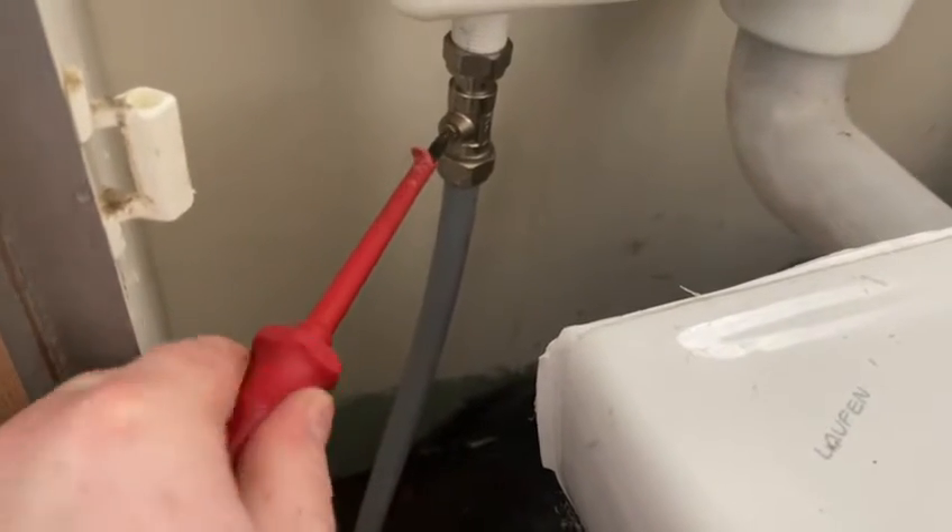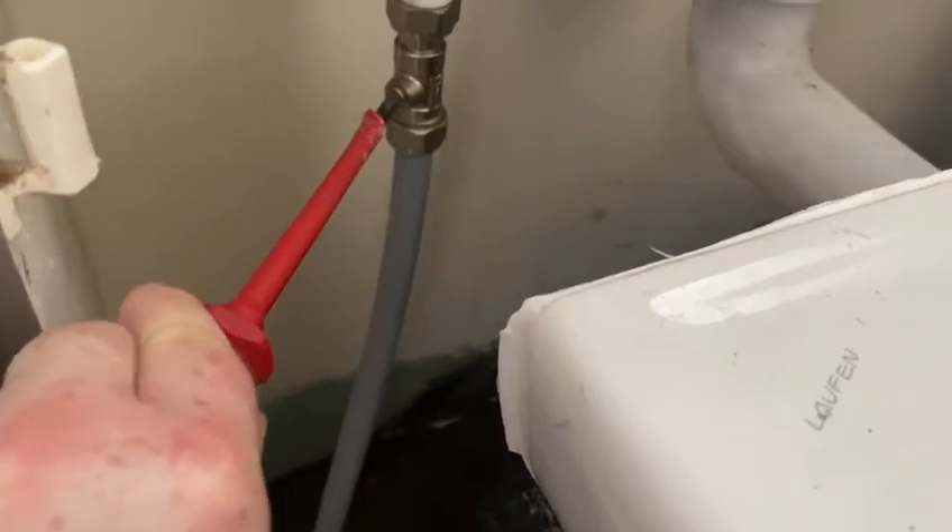So isolate the water, shut it off, so when you disconnect the toilet and change the seals, no water pours up and comes through. This is where it's been leaking from — there's a wee drip there and that's where the seals are up in that intake.